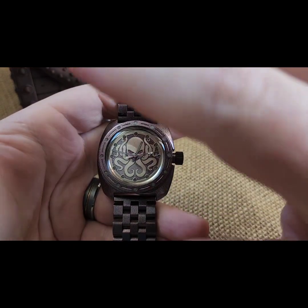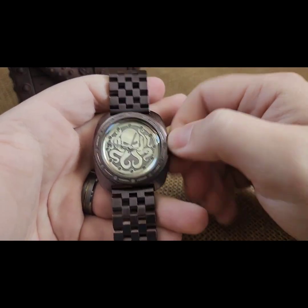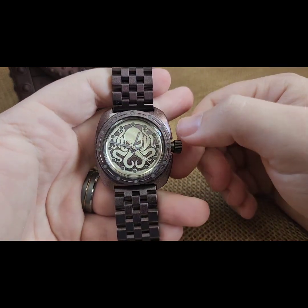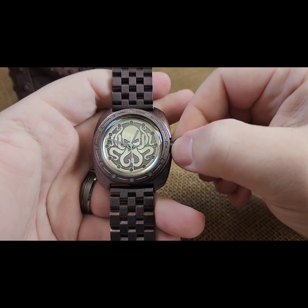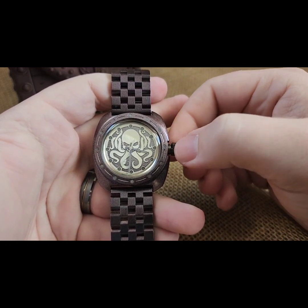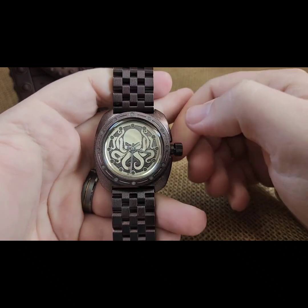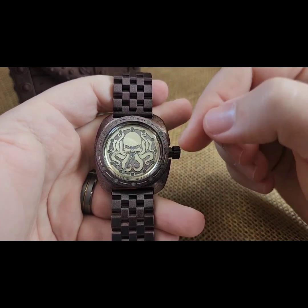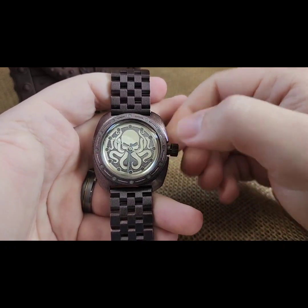That mixed with your rotor movement will run you through the day. But if you're not going to be active at all — like driving long distances or whatever — you can wind this thing up for 15 to 20 seconds and max out the 31-plus hour power reserve on it. You cannot over-wind it, so don't worry about that. The wobble crown deflects lateral pressure from the crown into the stem and into the movement, so when you're pushing and prying on it you're not putting any adverse pressure through the stem. Also, the clutch system disengages once it's screwed down, so if you have any impact into the crown it does not transfer into your keyless works or into your movement.